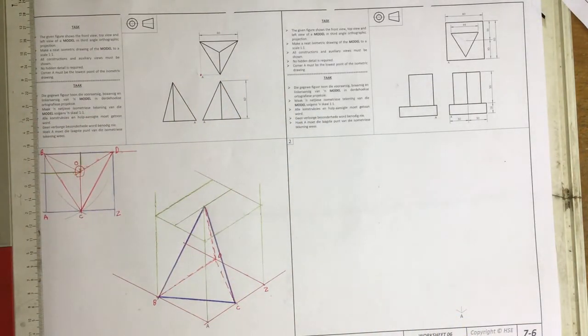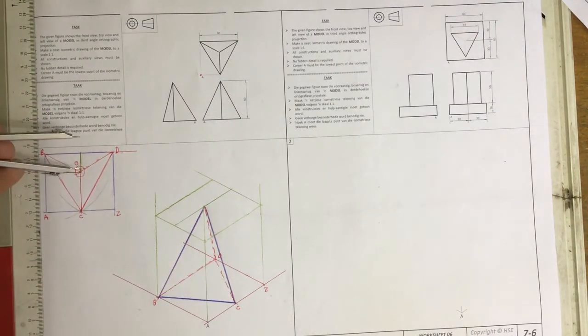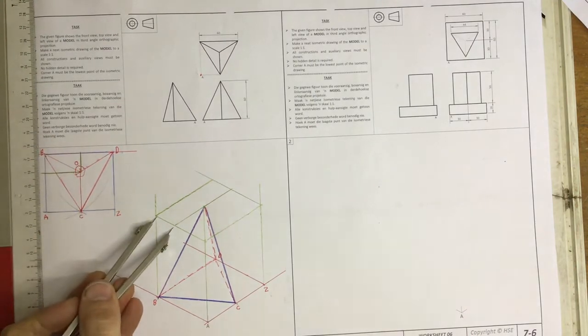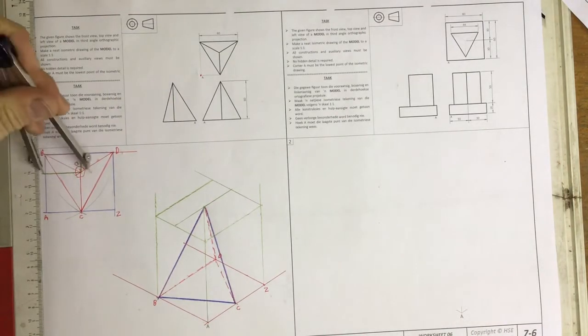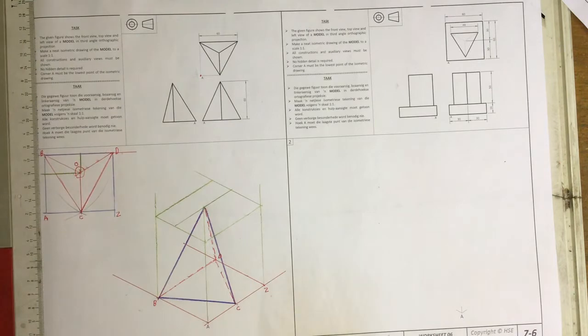Make sense? What's the secret here? Drawing an auxiliary view and then finding the distances — like point A to point B, and the distance from point A to point C, and then finding where the apex is — finding what that distance is from that back line. Drawing a line across, finding what the distance is from there to there, and labeling that as point zero. Not too difficult.